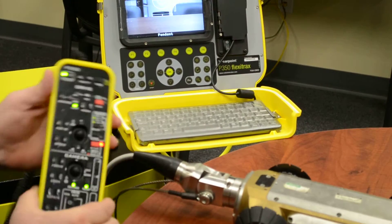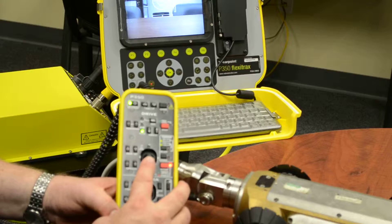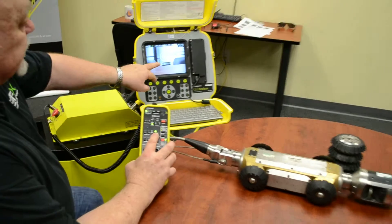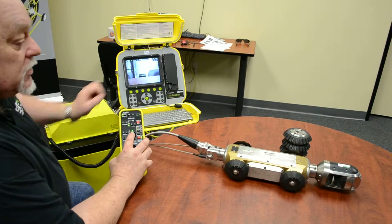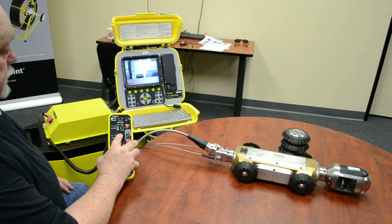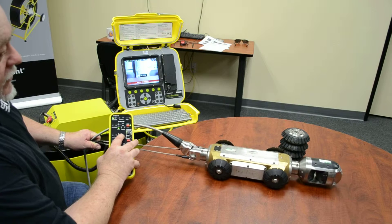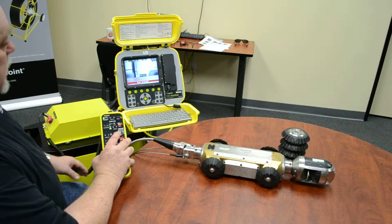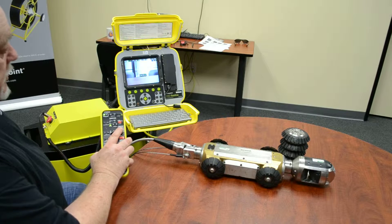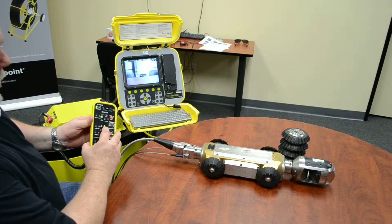Once it's in the hole, we have a joystick. We want to go forward - press forward and make sure the green light comes on. Plus you get a speed bar indicating that you're going forward. The same with the reverse. When you do that in auto position it will actually sync up with the drum. You can also put this in manual and we'll come back to that.